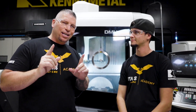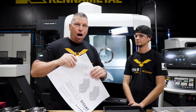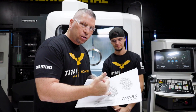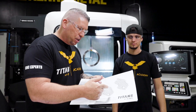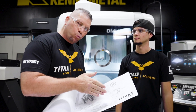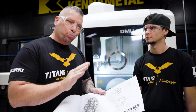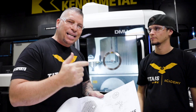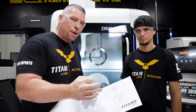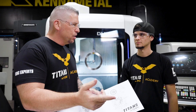That's what we're going to do here, and that is the difference in the Aerospace Academy. We're going to take a part — for instance, what we're working on here, look at that: metric and English prints. We're going to go over the part, and you're going to instantly understand that we're in a different world now, because we're going off of datums. We've introduced true positioning — we're talking about how to calculate true positioning — and we're going over the inspection and the entire process and strategic planning needed in creating parts like this to print.